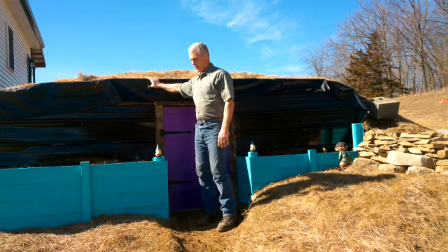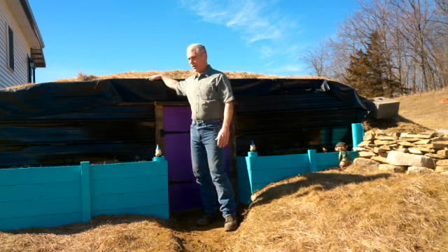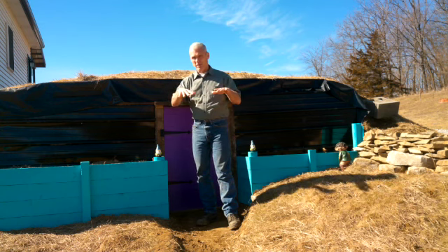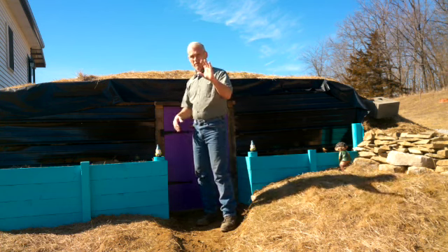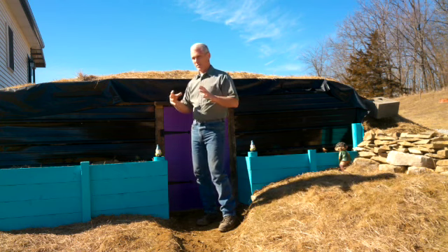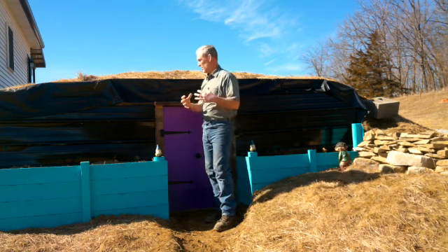The reason I put the hay down was because the pond liner is so slick. I was worried that if we had a really heavy rain and moisture pooled on the pond liner, the dirt might bleed off the sides — even though the roof is flat, there would be too much shifting of the soil because it would basically be too muddy. That thick layer of hay keeps the dirt from being in direct contact with the pond liner, and gives a little more structural integrity for the dirt to hold onto until the grass root system binds the earth together.